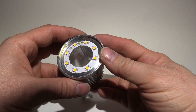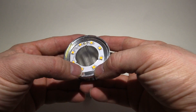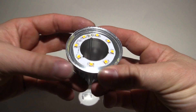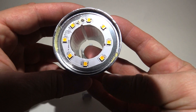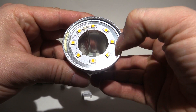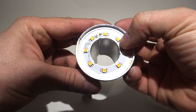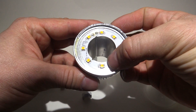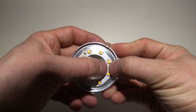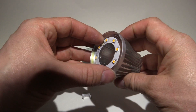And our LEDs — I had a look at the layout and they're connected in series-parallel. We've got eight LEDs connected four and four in series, and then those two strings are connected in parallel. The central traces between the LEDs are quite thick, and then there are thinner ones on the outside — the two thinner ones together roughly equal the same thickness as the central thick one. It's a very thin board which I'm not going to take off because I don't want to damage it — we've got to have some fun with it, like pumping 230 volts through it.